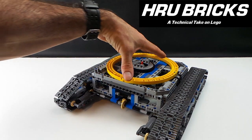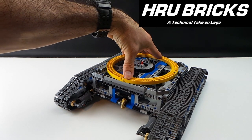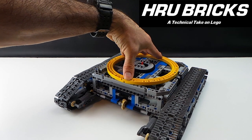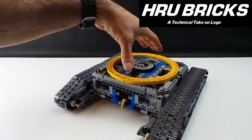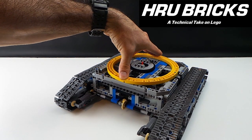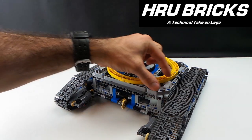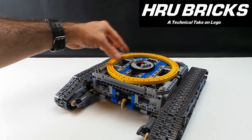The key thing is when you put your crane or your build on here, it's this movement. When you are turning your crane around, what happens is as the weight shifts, your frame will actually roll. This frame is quite rigid through the front and back, but not through the centre.